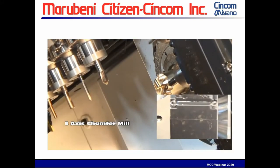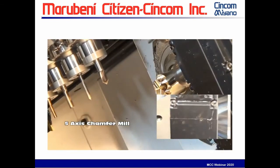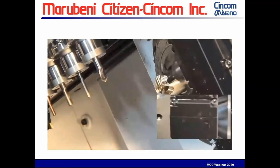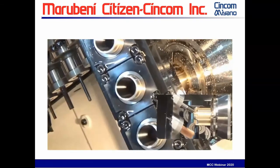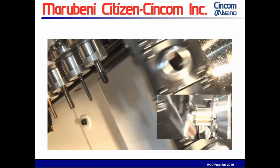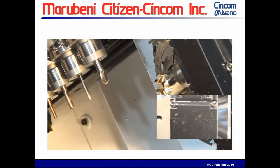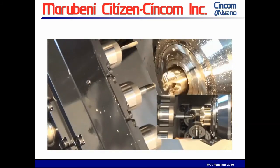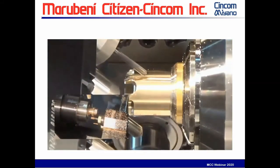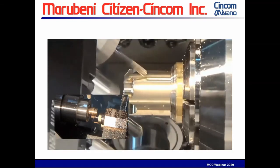Right now we're contouring around all these cross-working edges, so that you get nice chamfered edges all the way around, so the machine can contour all the way around it. Without this feature, there's going to be a lot of costly time and expense put into hand deburring these parts with not the same amount of control. Due to the angle drilling that we talked about earlier.